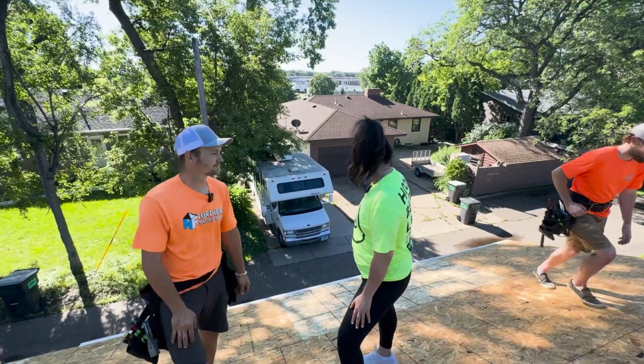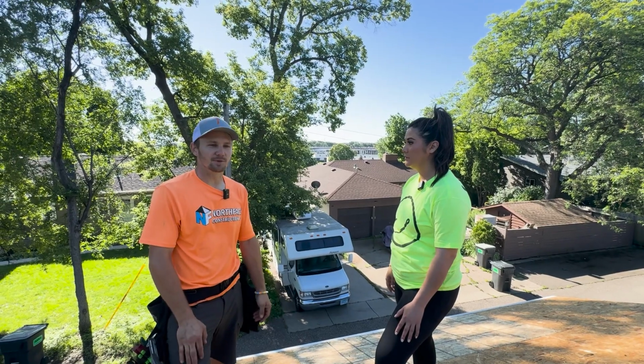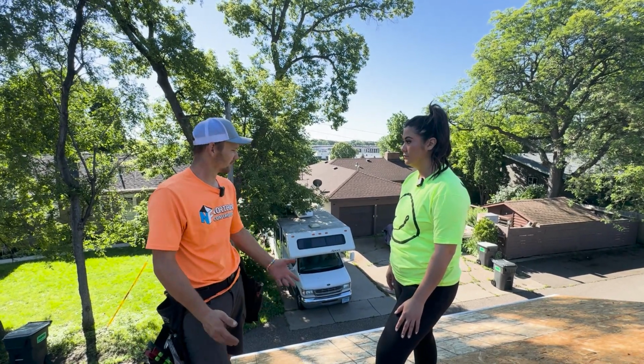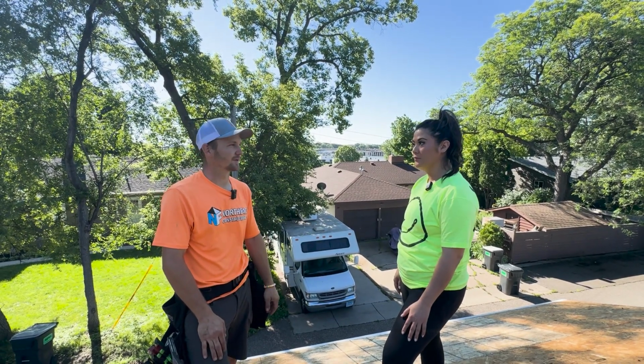So we're working on the edge of the roof now. What's a common mistake that you see happen at this part? I think some people don't put on drip edge on the bottom or a gutter apron if there's going to be gutters. We like to put the gutter apron or the drip edge on and then the ice and water on top of that, because that's what the manufacturer's specs say to do.